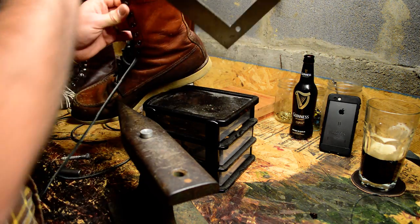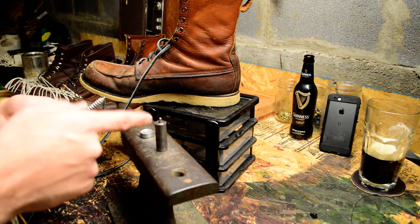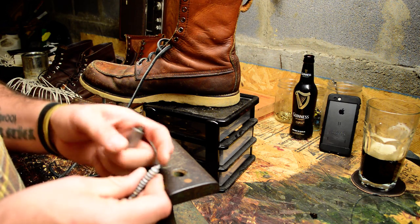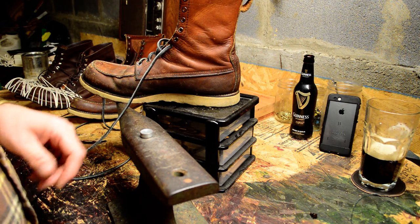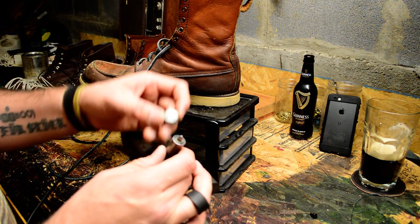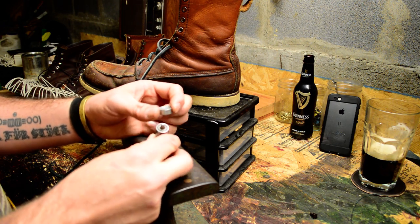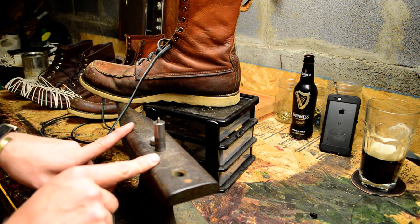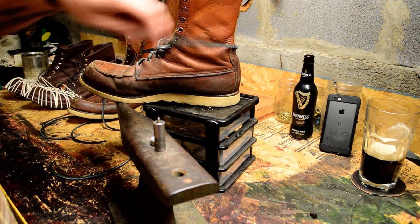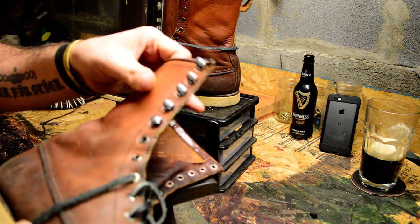Most of these things you probably have laying around the house. You don't even have to use the dome setter — you can just use a bolt. But the setter works better because the cone is nice and even, whereas the bolt has more of a spiral to it and doesn't seat as nicely, so I highly suggest picking that up. Both kits are probably under $15. I also suggest a level anvil because that will give you a nice surface to hit without it rebounding. You should end up with something that looks just like that all the way around — simple, cheap, you don't have to ship them anywhere.